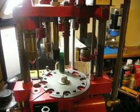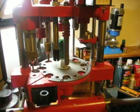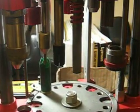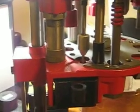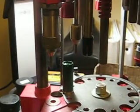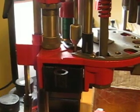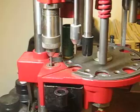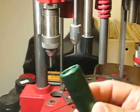The next pull is actually going to start the crimp. I'm going to go a little slow here so you can see it. The crimp is actually getting started right there. It's going to rotate to the next one — here you're going to see the crimp getting finished. And in the next stage it's going to get a nice little roll. I'm going to try to catch it before it comes out and falls into the hole. And there you go — that's a completed shot shell.